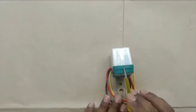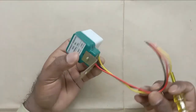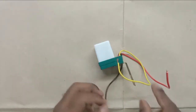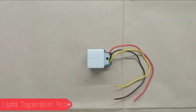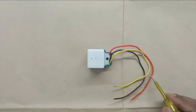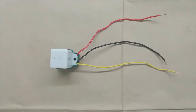Now let's learn the connection of this sensor. As you can see, in this sensor three wires are provided. This red wire is our phase wire and this black wire is for neutral. The output command we get through this yellow wire. Inside this sensor, one LDR is also connected. The work of the LDR is: when light falls on it, it stops generating the output command. And if light does not fall on it, the yellow wire will provide phase supply as output.